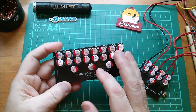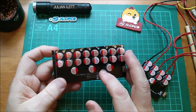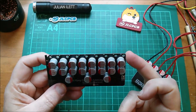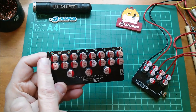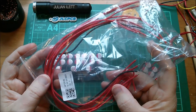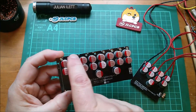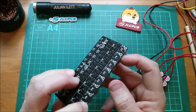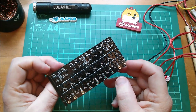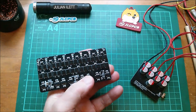So I think what I'll do is I'll go and get the battery from the shed, disconnect the BMS, disconnect the high current stuff, bring it in here and attach this. I think what I'll do is simply put the most negative on first — the black wire — and then just add the wires as I go. Only when I get to the B7 wire will this actually power up, and then I'll attach the B8 wire. You get a full set of nine wires — eight red and one black — and they're these nice bendy silicone ones. I'm just going to snap this bit of board off, which hopefully is not needed.